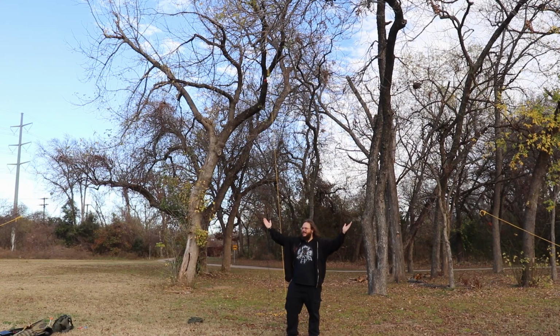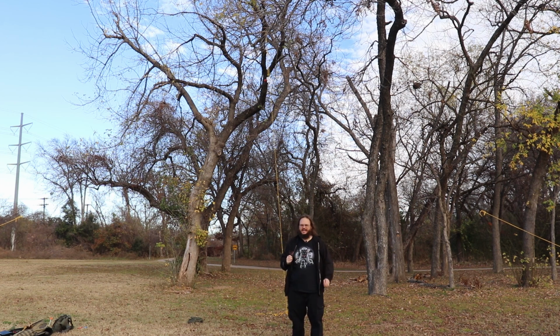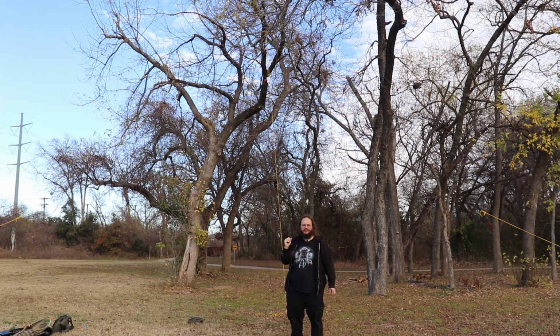There she is. I set it up as an inverted V because I'm probably going to be deploying it like that most of the time. I'm not going to have enough space to stretch it out and do a dipole straight up in the air. Plus in the inverted V configuration, you can almost get an omnidirectional transmit and receive. If you just set a dipole up straight, you'll get a directional antenna. This configuration is a little less directional, and this is probably how I'll deploy it.